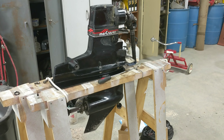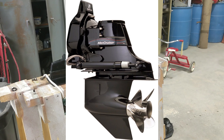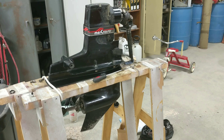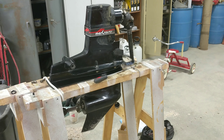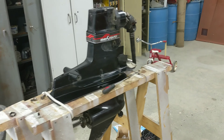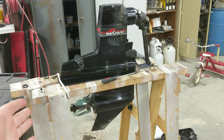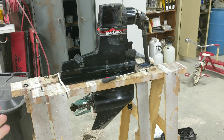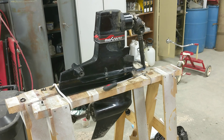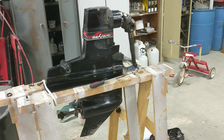There's alpha drives and Bravo drives — those are the two most common ones. Bravos I kind of think of like a three-quarter ton truck compared to a half ton truck: they're the heavier duty, higher power rated versions. What we're looking at here is an Alpha Gen 1 / Gen 2. Alpha is the name of the series of drive, and there was a Gen 1 and a Gen 2. Bravos are like the big dogs.